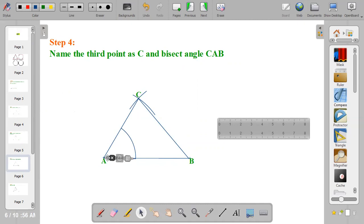Draw a small arc, then center at the first intersection point. You may reduce or keep the same radius — you get the same results. Strike an arc, then take it to the second point using the same radius and strike another arc above. Join the point of intersection of the arcs to point A. This is bisector one.